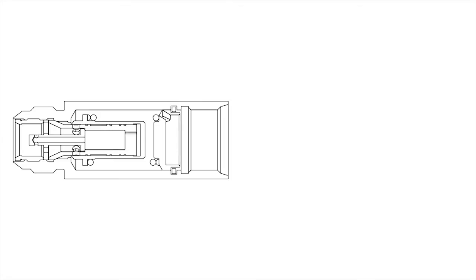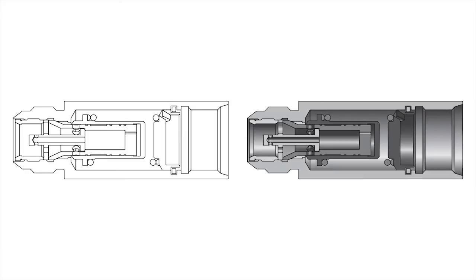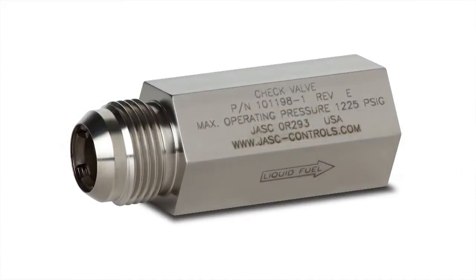However, in the meantime, there were some issues that were severe in the field that didn't allow the engines to be run by the users for any long period of time. So this gas turbine manufacturer also approached Jask a second time, asking if we had some solution for the check valve instability problems. We came up with the design that they're using today in the field, and it consists of what we call an inverted spool, which incorporated a Helmholtz resonator in a way of sensing the pressure that made the device very stable. We went through a development program on both the bench and the engine, and this is something that has to be very well thought out and very rigorous because there are a lot of issues out in the field, especially for power generating turbine engines. So we had to make sure that the design was fully developed before it went into serial production.